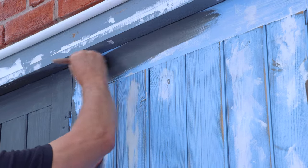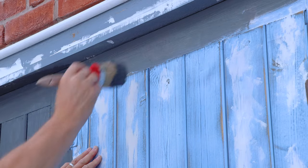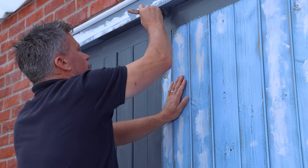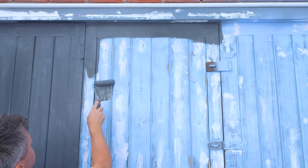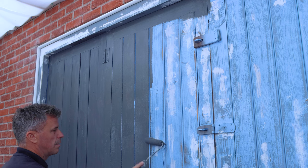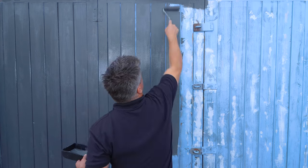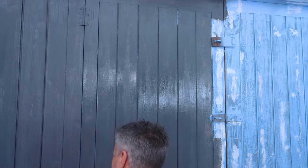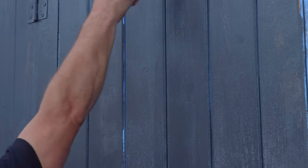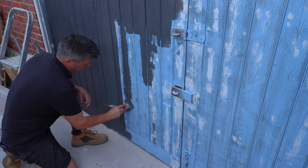My garage door consists of four separate sections that all bi-fold together. I'm going to start with my paintbrush painting around the outside edge and the tricky bits around the hinges, then continue using a small four-inch radiator roller. This is a little bit quicker for applying paint on larger areas. However, it's not so easy to get in between the grooves, so you may have to use your paintbrush to stab in between them and then quickly roll over the face. Sometimes by tilting the edge of the roller you can get in between them. Either way, if you do apply the paint with your paintbrush in between the joints, always finish it off over the surface with your radiator roller.